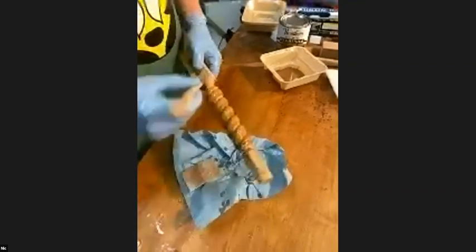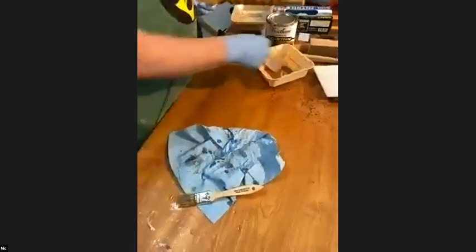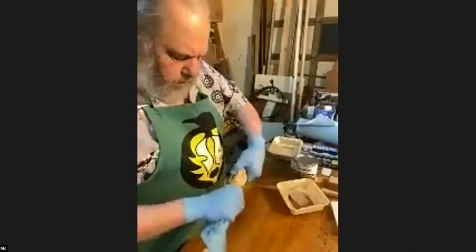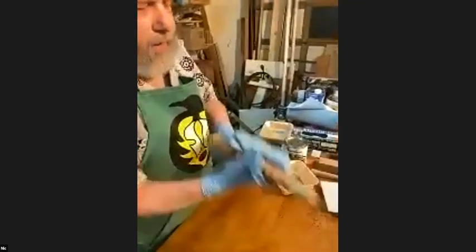Here's a good example of something that would be a nightmare to brush and not easy to spray, but putting it on this way is going to be plug easy. I use my brush to get finish into all the tight areas, then wipe it all off. I usually leave the Scotch-Brite out to dry as well — nylon won't create any problems, but it's a good habit. Look how nice and even that is.